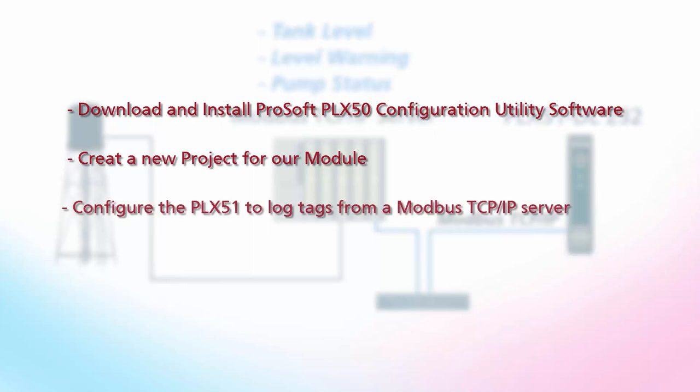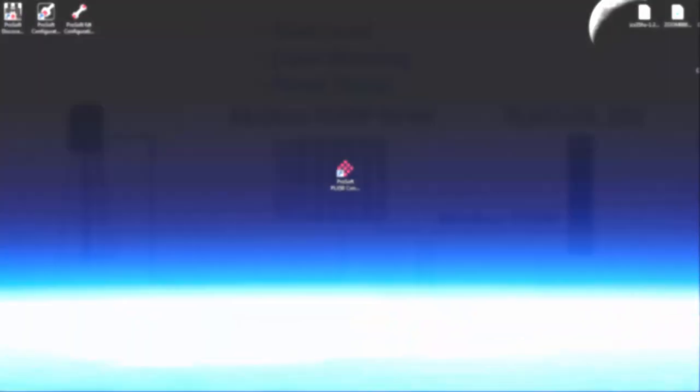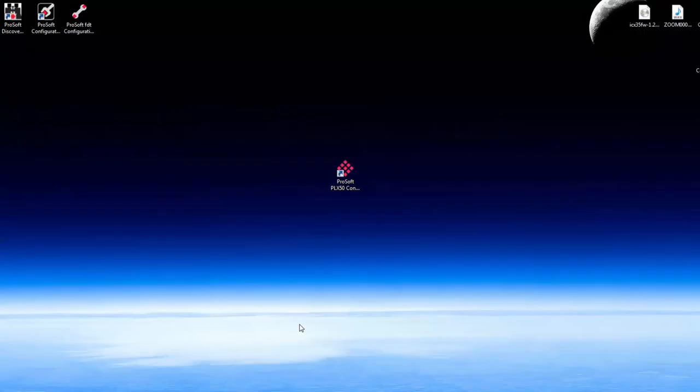We'll cover downloading and installing ProSoft PLX50 configuration utility software, creating a new project for our module, configuring the PLX51 to log tags from a Modbus TCP IP server, and we'll view the log data and save it to a CSV file. Let's begin. The first thing that we need to do is download and install the ProSoft PLX50 configuration